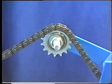During its lifetime, each roller chain is submitted to an average elongation of 2% of the total drive length. Without a continuous compensation of the increasing slack, chain drives start to vibrate and jump and wear out rollers, bearings, and sprocket teeth.